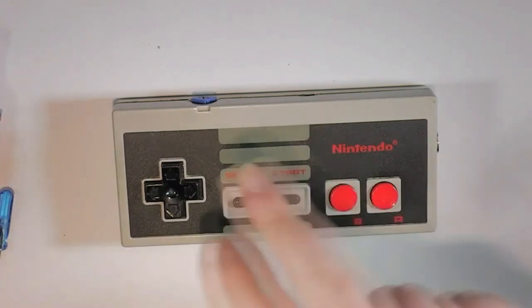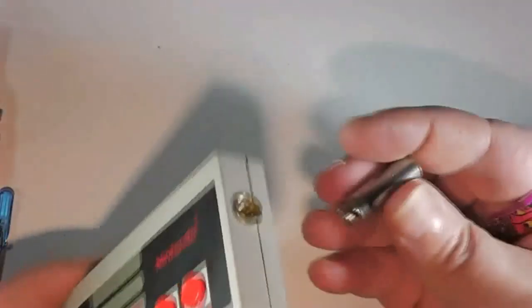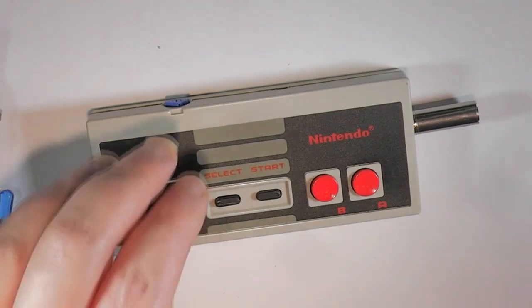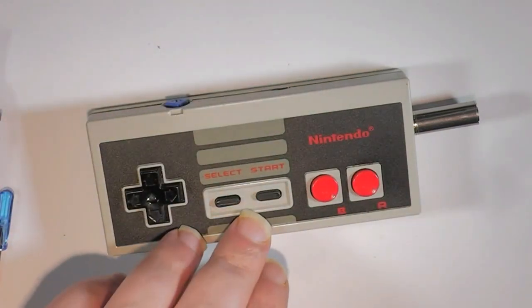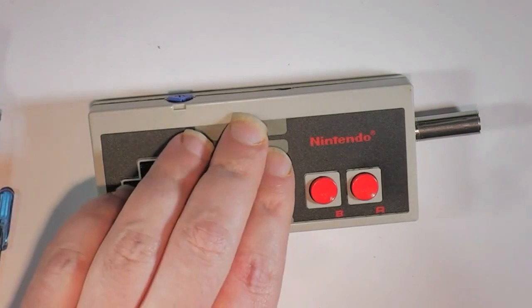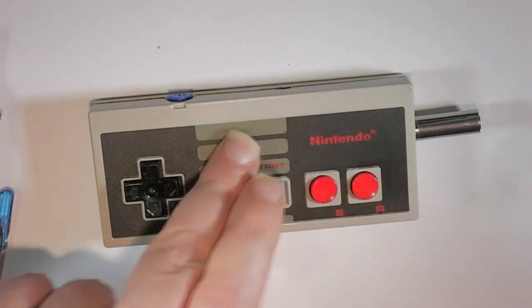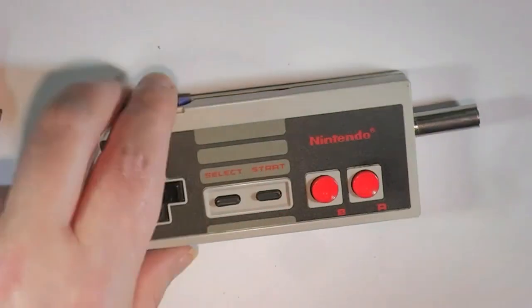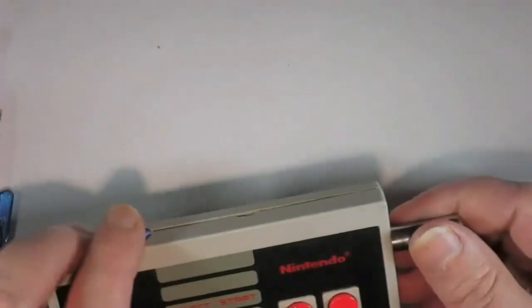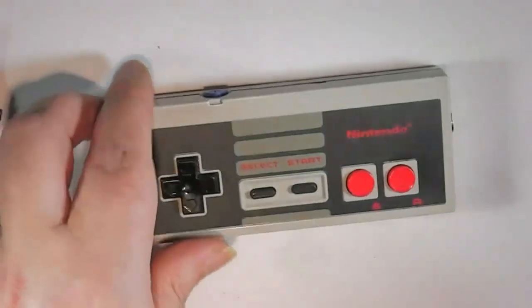You may be wondering about the charging, as of course the Ego C has built-in charging via an ordinary Ego charger. But what I'll do, I'll add one of these charging extensions onto here. And what I use is one of the 5-port battery chargers for the Egos. It's only 150 milliamp charging, so it will take a little while to charge. But using that, I know I can put any device I like into that charging unit, and I know it's going to charge safely. So all these different mods I make with built-in Ego style charging all go into that, because they've got various different batteries in. I don't want to risk anything, so that's what I'll be using.